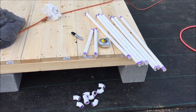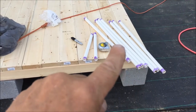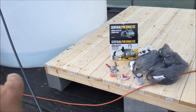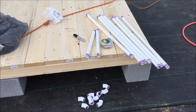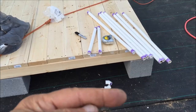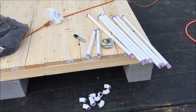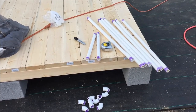This is for the aeration — it'll sit at the bottom. Each one of those pieces there are two and a half feet long. This is an 86-inch wide opening at the bottom here, and I kinda want it to go as far close to the bottom as I can. That's just an educated guess, folks — much like most of what I'm doing here. Those are all 45s, there are eight of them and a tee, so I can bring the stand pipe up. It's going to bring the air down to this octagonal shaped aeration system, and I'll be drilling one-eighth inch holes all the way around.